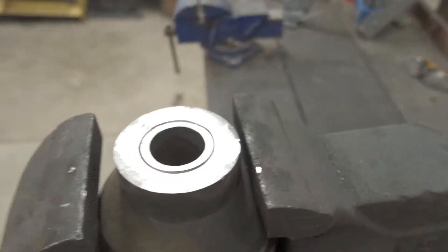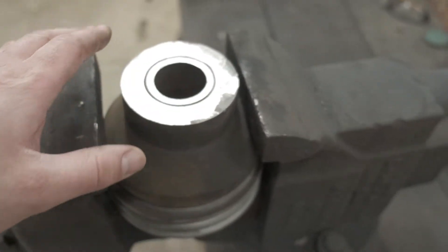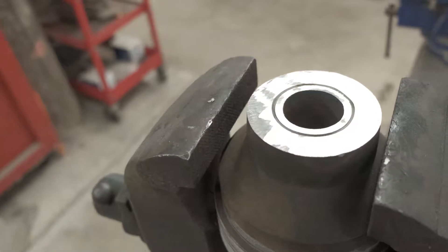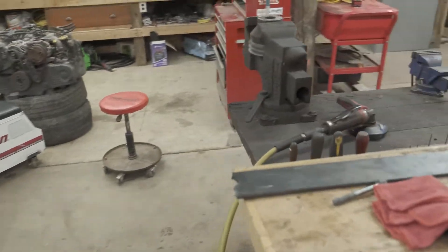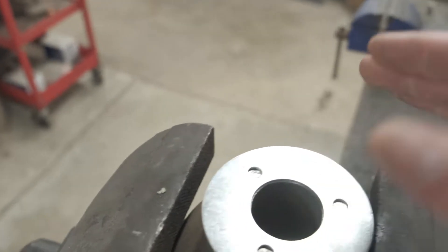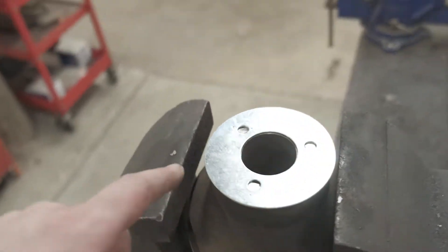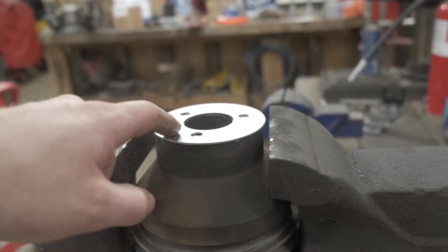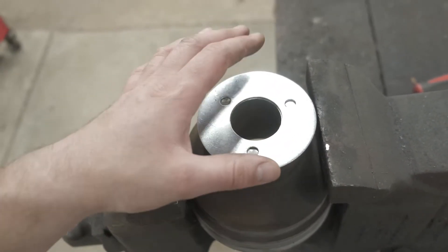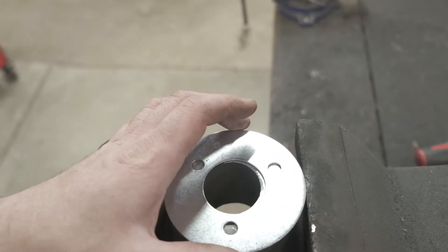What we're doing here folks is we welded shut four holes on this and we ground down the little lip that was in the center so now it's flat. We're going to get a straight edge and try and true it up as much as we can. Then we have to convert that to a three-bolt flange. This three-bolt flange basically has to go here, perfectly centered, and then we had to drill three new holes all the way through. It's pretty thick. This pulley will then bolt straight up to the Predator motor. I'll keep you updated and let you know how it goes.